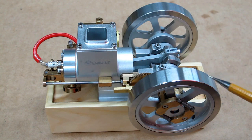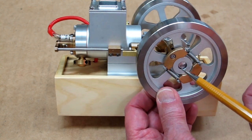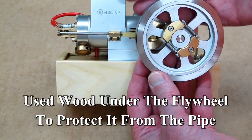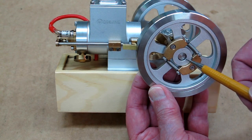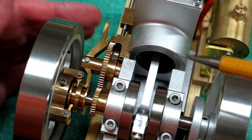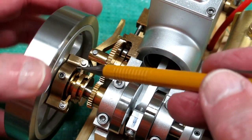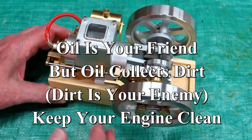So you may want to decide not to use the electric starter to start these engines. This flywheel had moved in on me and I had a hard time getting that shaft back recessed like it is now. When this was removed, I supported this across a piece of pipe and let this hang free, and I beat on that crankshaft with a wood dowel using a wood mallet. You do not want to beat on this with a metal or even a brass punch because you're probably going to mushroom the end of that shaft — there's a good chance this engine will then become a paperweight. I tried to run it and it would fire a few times and then stop because this bar didn't have enough clearance and was holding the exhaust valve open. All you have to do is loosen these on both sides and move this out a little bit, which will slide this closer to the engine, then re-tighten those.